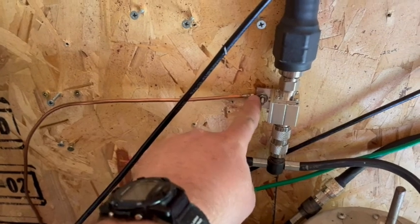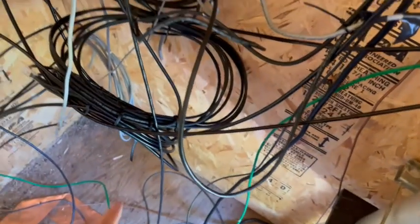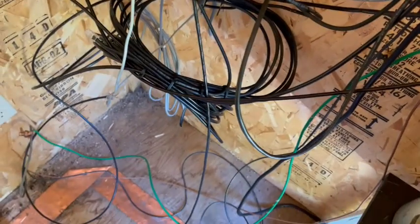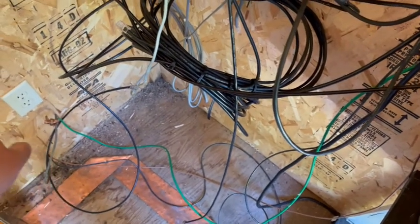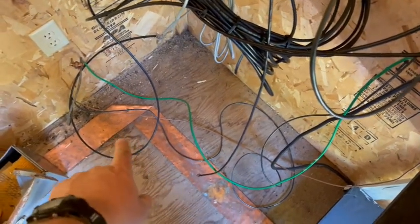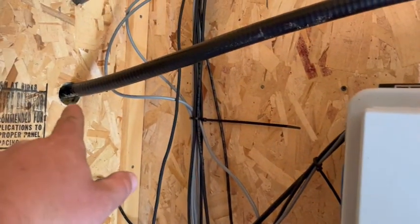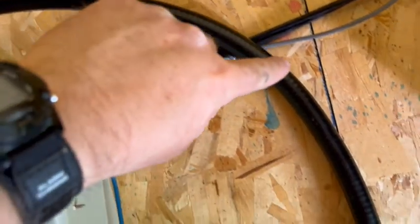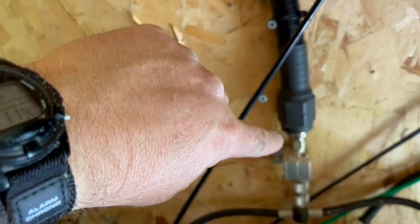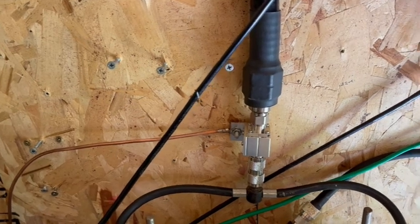This is all soldered together — solid copper wire, nice wide gradual bend going down and out to a ground rod. There's a copper strap down there but I don't think it's actually grounded; I can't see where it's connected to anything outside. And here's the transmission line coming in with a nice curvature to it, coming down and connecting right there. She's up and running.